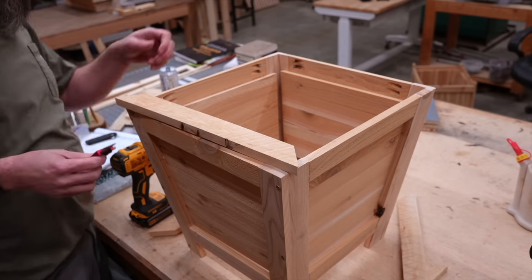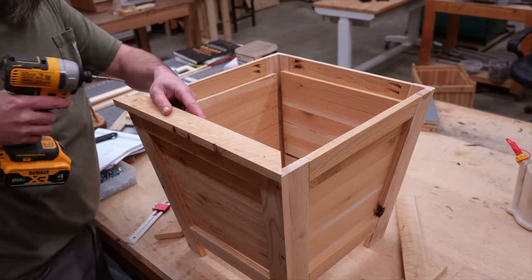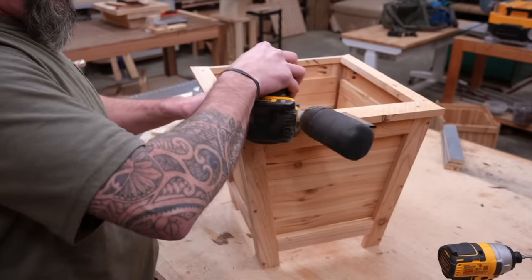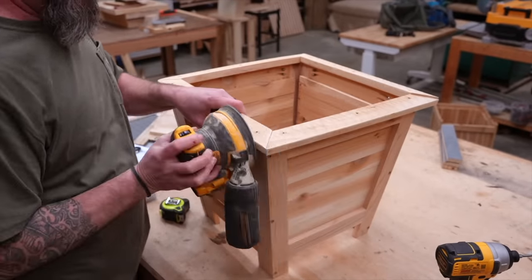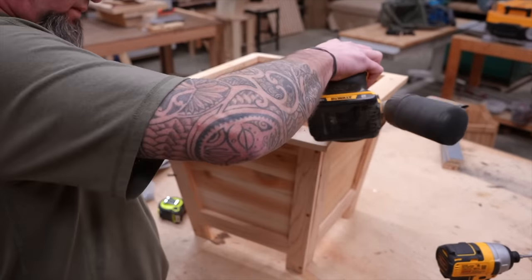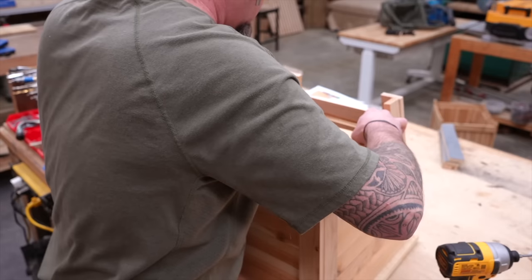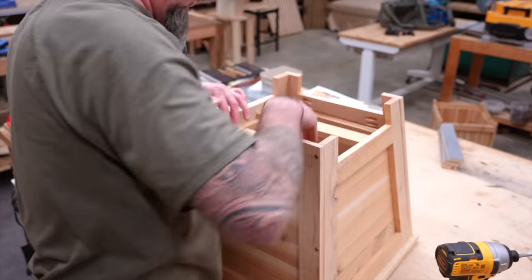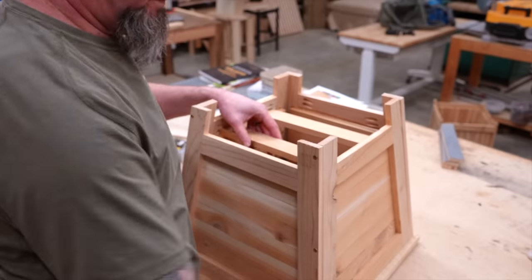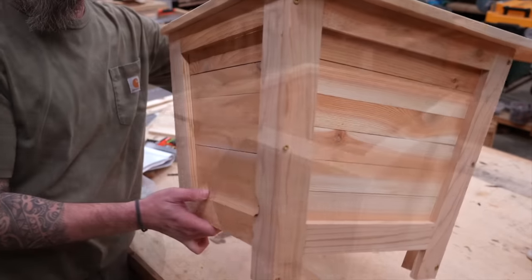Now to install the trim — I'm marking my screw placement and pre-drilling my holes. Once that's done I'll attach the trim with the same inch and a quarter deck screws used earlier. Keep in mind that with fence picket material, the angle may not line up exactly, but they are super forgiving with just a little sanding and it will look great. Installing the floorboards, Part L, is a lot easier. Since the entire box is at an 8 degree angle you may have to angle your boards to get them into place. Once in place, just pre-drill and add some screws.